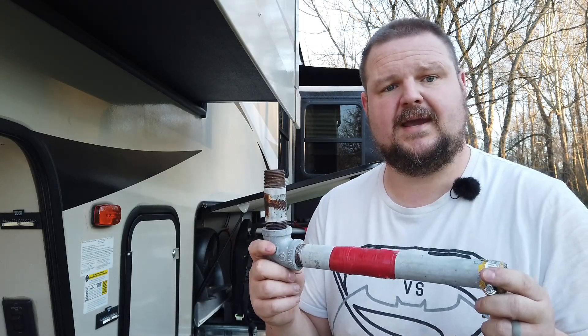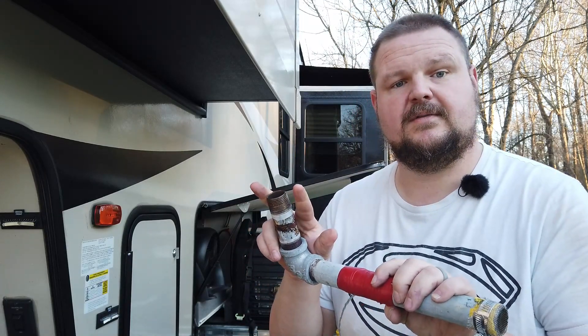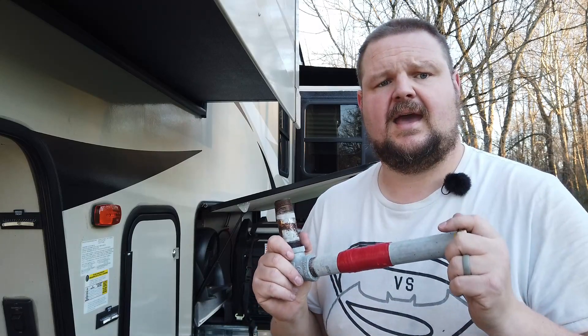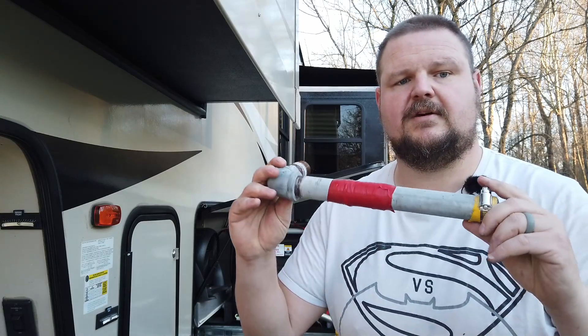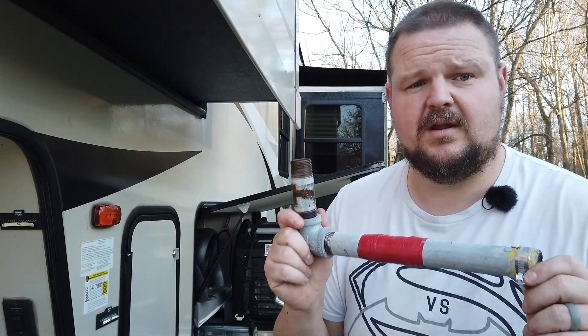I had to make the adapter — it was a pain — and there are only two screws that hold that in. That's where the spark arrestor was, up on the sides. Even after a couple of different updates, adding some heat-resistant Loctite and star washers, they just kept vibrating loose after a little while because the assembly was just too heavy.